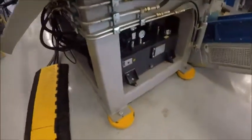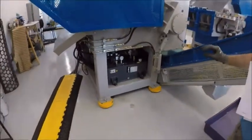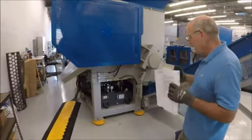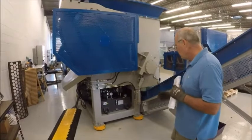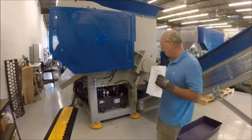Change your filter and any fluids you may have in your hydraulic system here. It's important to always maintain your hydraulic fluids and clean your filters. These hydraulics are such an important part of these machines and they really get worked hard, especially in the summer, to prevent any heat-ups or deterioration of the system when it gets hot and humid within your facilities.